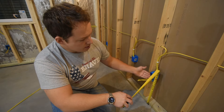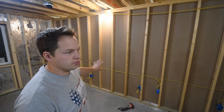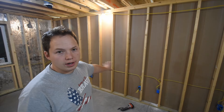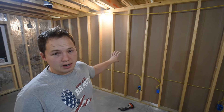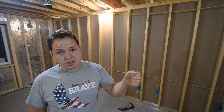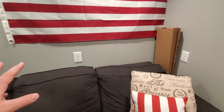My opinion is that 16 inches to the top of the box is about perfect. We're in kind of a basement living room area and we're gonna have a couch probably along this wall. That naturally blocks all of your receptacles, so you can't really have access to them. One suggestion would be to possibly add a receptacle above the back of the couch. You're always looking for a spot to plug in your phone charger, and adding one at that same 48 inch height is about perfect so you can conveniently plug in your devices.